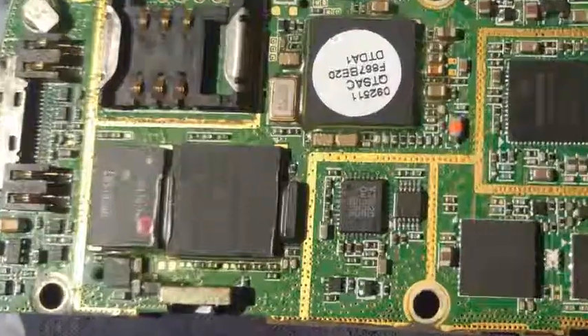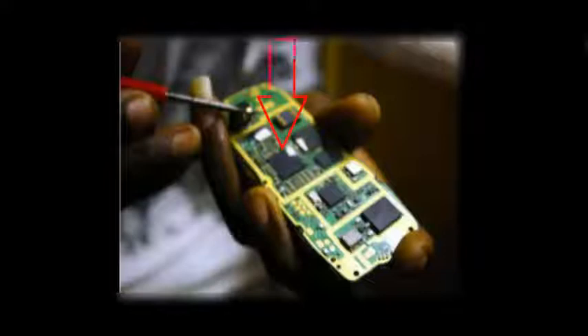Some ICs are punched by machines onto the circuit and fixed at the corners with glue. To remove this type of IC, take a knife used in a biological laboratory and heat it until it gets red at the front. Remember that paste must be used when fixing chips. Take the heated knife and place it slowly under the chip as shown in the image — the heated knife will easily move into the chip.